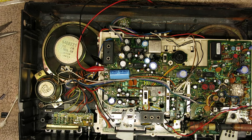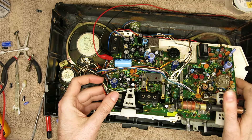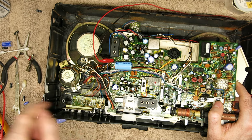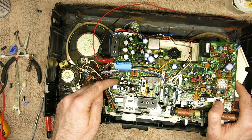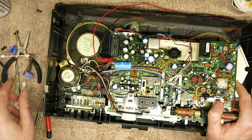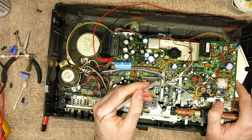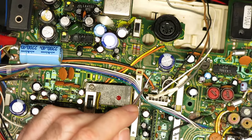So far in this area we're okay — I think the next likely fault is in the power amp stage. There were definitely two issues going on, with one masking the other. Oh, problem solved! It sent me on a bit of a goose chase because it was nothing to do with the power section of the amp chip at all. Remember I pointed out that this Panasonic purple-jacket capacitor had shown signs of corrosion? Another one of the same type — and I think this one and this one are too — had actually corroded a trace.